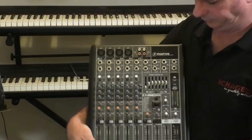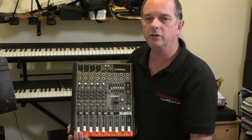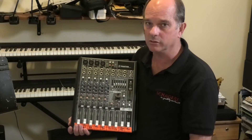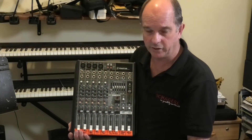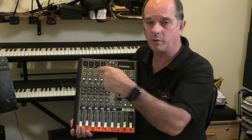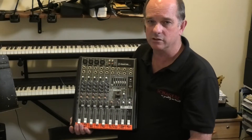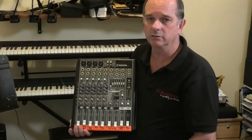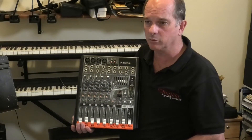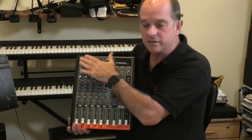So we come up to the front. The simplest, most efficient way to figure out what's going on and what's going wrong is to follow the cable. You have someone talking on a microphone, the microphone stops — start at that microphone and work back. It might simply be they've switched it off. As a sound person, microphones with switches are deadly — I usually tape them up so they can't touch them. Follow it: it might be a cable that's broken. Are they plugged in? Is it in the right spot?